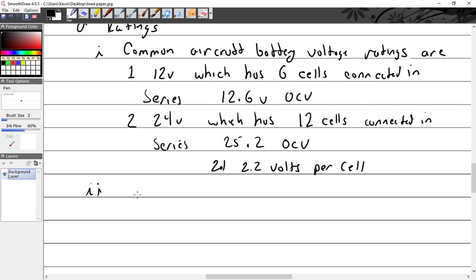The reason that happens is that Cessna 150s all have 12 volts. A Cessna 152, which looks exactly the same except it has a light on the front, is 24 volts. Then the 172, at least the older ones, are 12 volts. The 310 is 24. The Skymasters are 24, because we had to share the battery. The Bonanza is 12. So it goes back and forth, so pay attention.